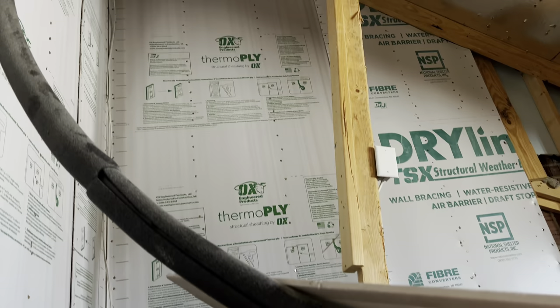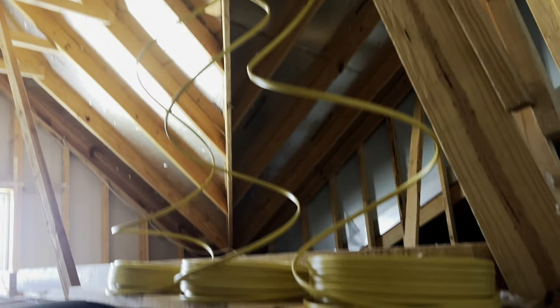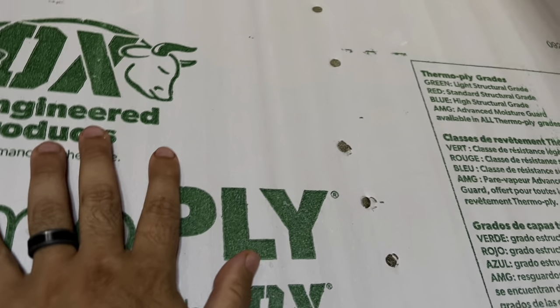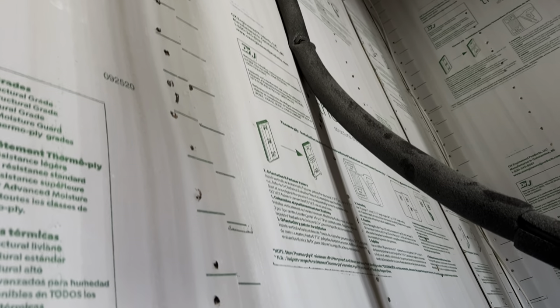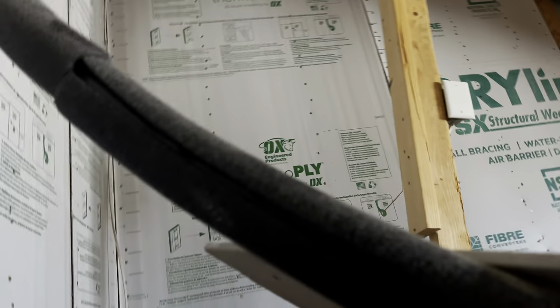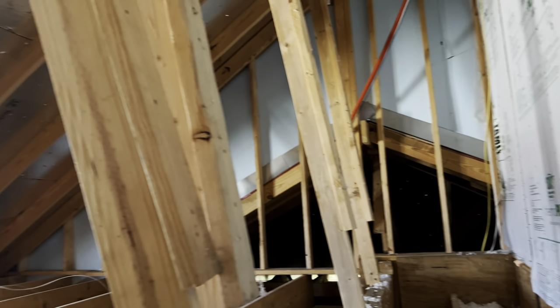Let's pop up here real quick — this is going to be the attic. The way this process works is pretty simple: you have an origin, which right now will be the outlets on the walls, and you also have your destination. The guys already have the yellow Romex out — this is the standard 12-gauge stuff you'll use for 20 amp as well as the 240 circuits. That wall right there is my guest room, and the line has to go all the way to the back right corner of the house where the theater is. You basically just run the line through the walls or up and over the attic, then install a dedicated 240/20 amp plug.